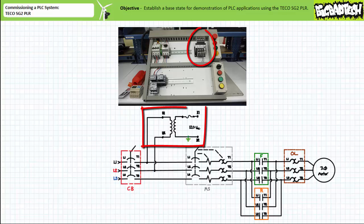Immediately downstream of the circuit breaker, a control transformer steps down the 208-volt line-to-line voltage to our chosen level of pilot-level voltage, 120 volts AC.